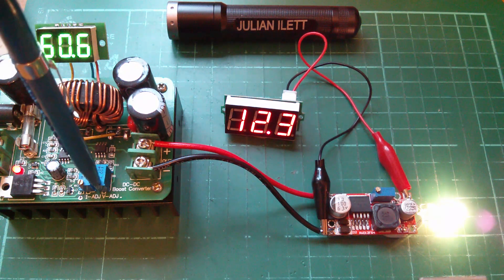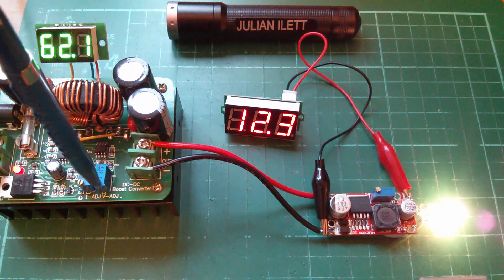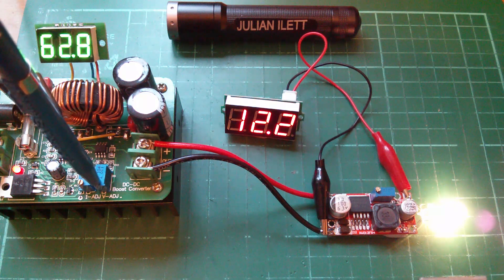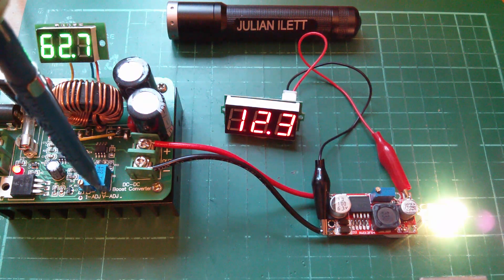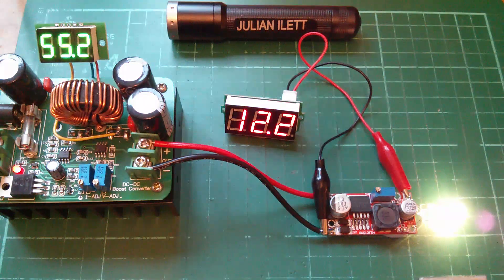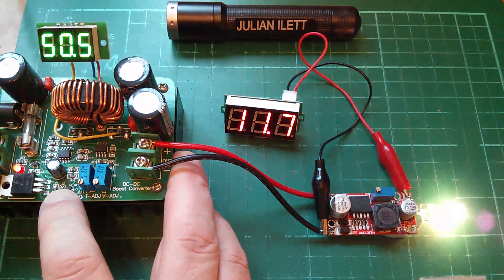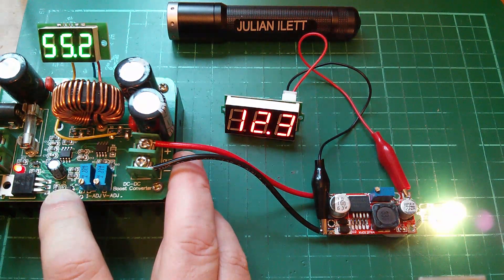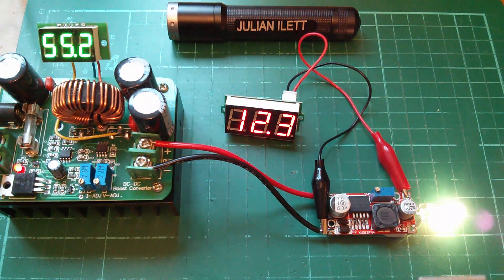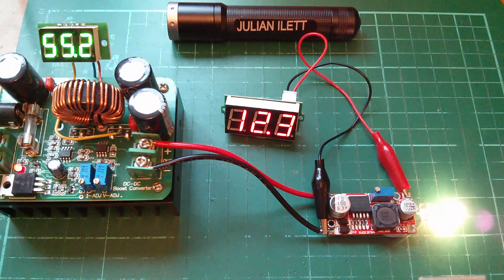I'm going to take it a little bit further, because that input capacitor is rated at 63. Let's see if we can go to about 62. That's a little bit high — 62 and a half. Well, seems happy enough with that. Now I've dropped it back down to about 55 volts and I'm going to see if it's happy to have that switched on and off a few times. So this regulator seems quite reliable: it can take over 60 volts, can take pulses of 55 volts, and the output is regulating reasonably well.